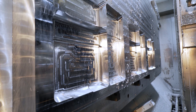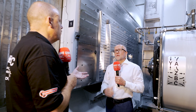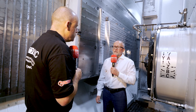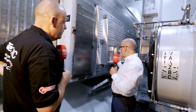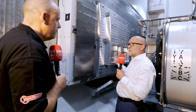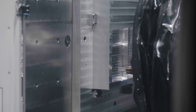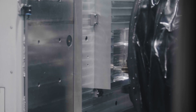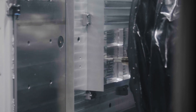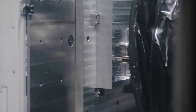Give our audience a flavor of the speed and the amount of metal being removed. When we're roughing, we're cutting at 28,000 revs, 30 millimeters deep — straight in, full slot — and we're pulling about seven liters of material a minute. When we're finishing, we're actually finishing at feed rates of 20 meters per minute with five-axis simultaneous movement.